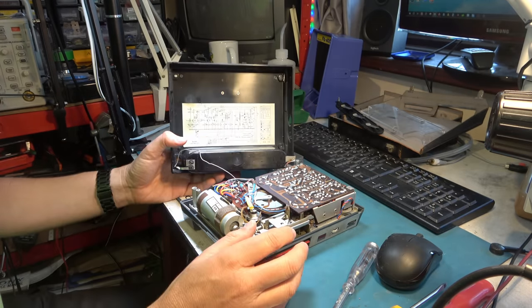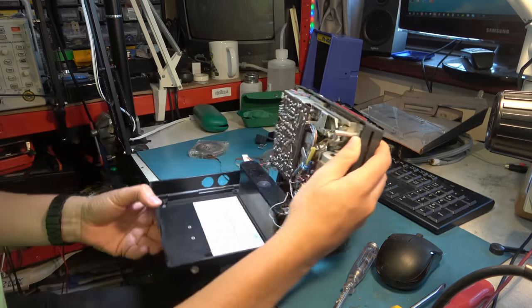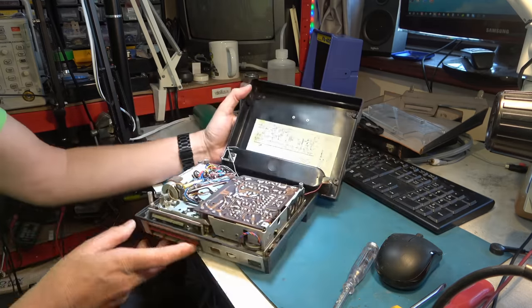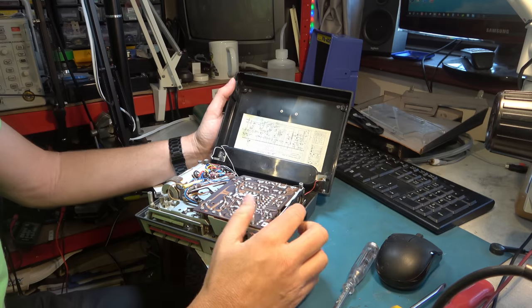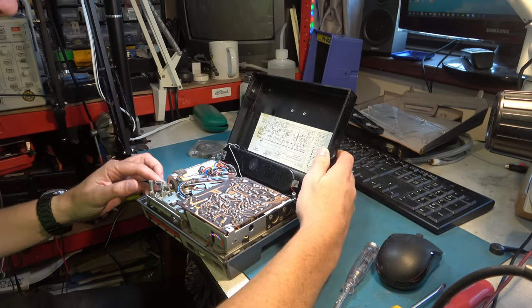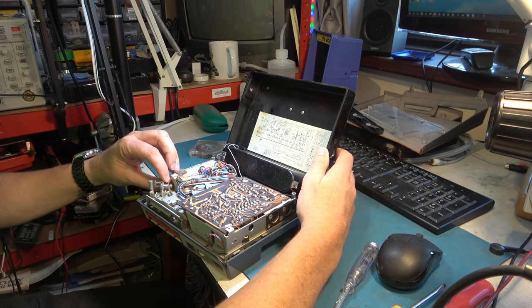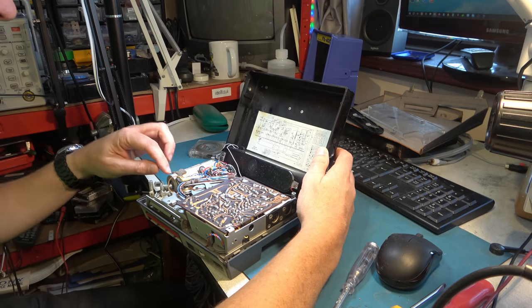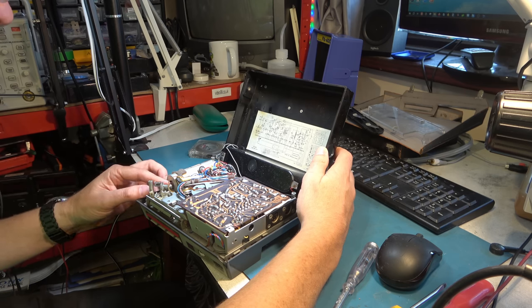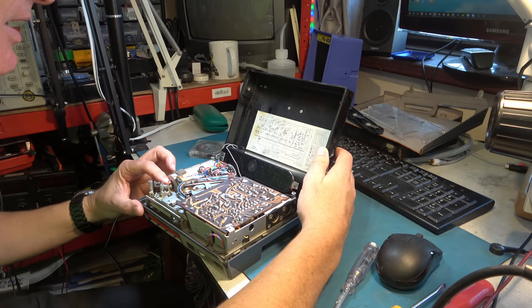Let's take it apart. Schematics - that's useful! Looking at the vintage, we're looking at AC128 transistors - germanium transistors. There's a big motor here with no drive belt on it. What would have been even more useful is a layout of the drive belt, because it's not obvious. Interestingly, it does not appear to have a speaker, so we're going to have to pick up the audio from that DIN socket at the side.